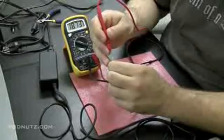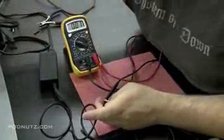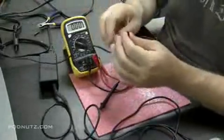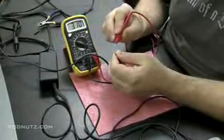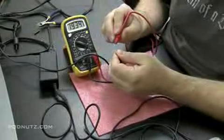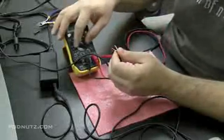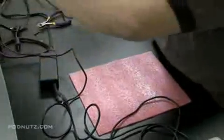And that time it goes pretty much straight to 18. Now sometimes those power bricks take a little bit of time to charge, but that usually shows a sign of weakness when that happens. You're also going to notice the part coming out of the power brick is frayed as well on this power adapter. So that's going to need to be repaired too.